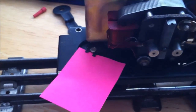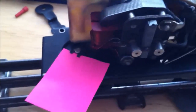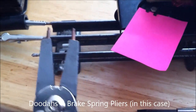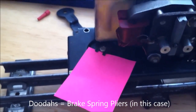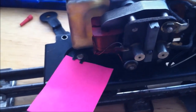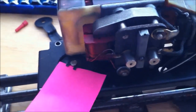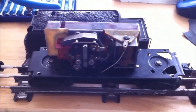I'm about to put a horseshoe clip in there. I don't like to scratch things up, so I slide a piece of paper underneath the horseshoe clip and I'm going to squeeze it into place using these little tools. The horseshoe clip really has a flat side and a rounded side. What I like to do is put the rounded side facing the frame, and then add a little oil to it after I'm done. Let's go in and see what our 6020-W sounds like.